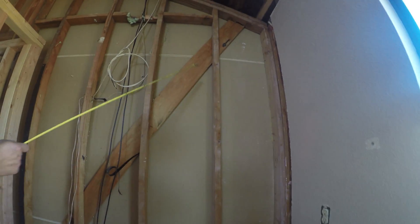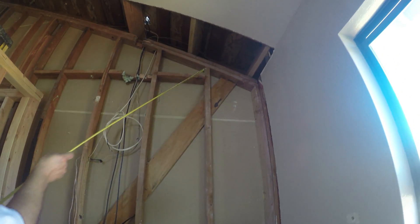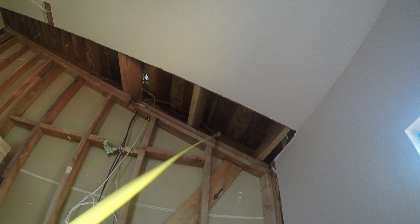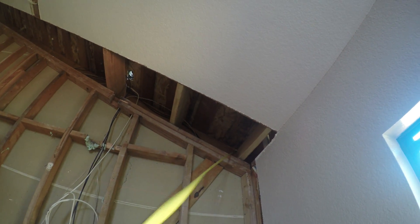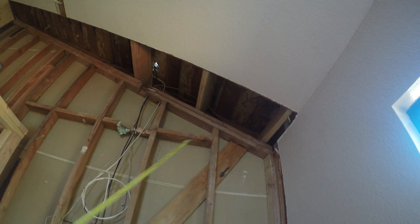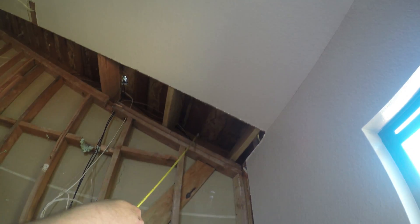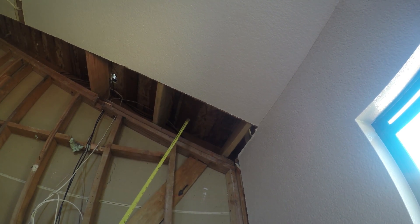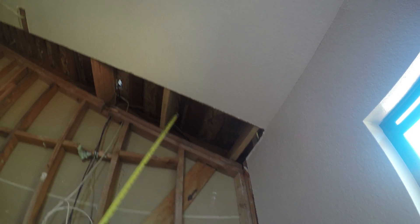This wall, in a structural way, is supposed to be connected with the roof member and the structural member. On the top, you can see the inside — this is the rafter. That's the roof structural member. This wall is in between these rafters. Once it's in between, this wall needs to connect with the roof structure. You have to use blocking.